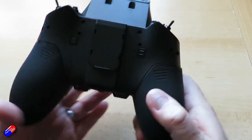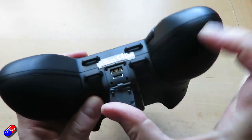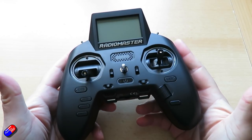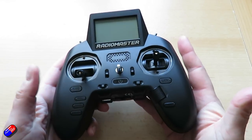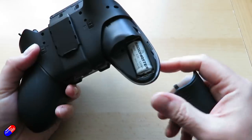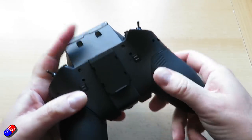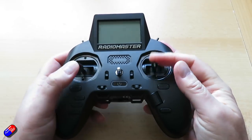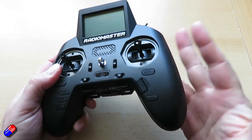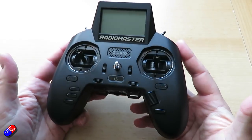For power, this radio has two small lithium-ion batteries — we'll look at those in a moment. There is USB-C QC 3.0 fast charging, and the maximum power output for the ELRS version is 250 milliwatts. There's not expected to be a 900 MHz version; the ELRS version is 2.4 GHz. The two 18350 batteries are used to keep the radio compact and light. I'm a little disappointed they're not using 18500, but the bigger gimbals take up space, so there's a trade-off.